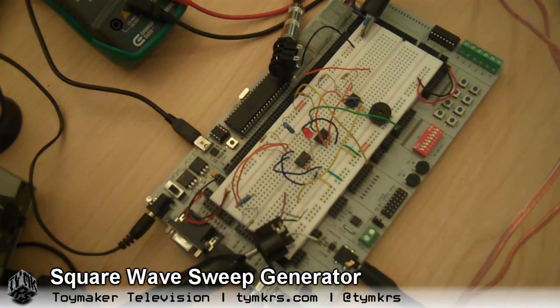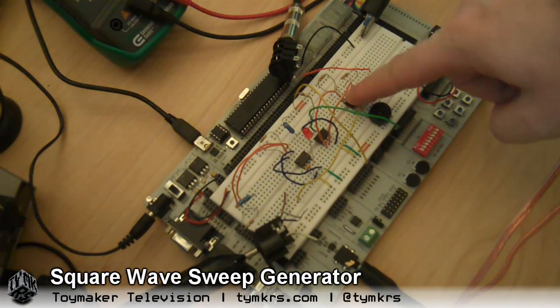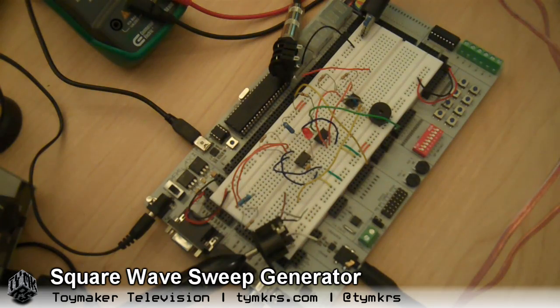That's what I've been working on, but this is just a stepping stone to another project. Instead of having this control a 555 timer, I want it to control a low-pass filter in an RC circuit. The capacitance value will stay the same but the resistance value will change through the digital potentiometer. I'd like to build that into some sort of a microphone effect — a little box that you plug a microphone into, plug the other side into recording studio equipment, and you've got this analog passive filter that can sweep up and down depending on whether you're stepping on a button or not.